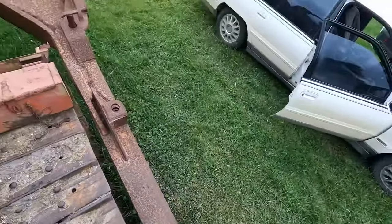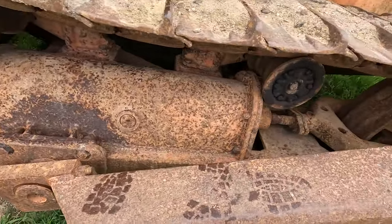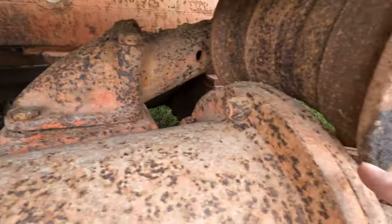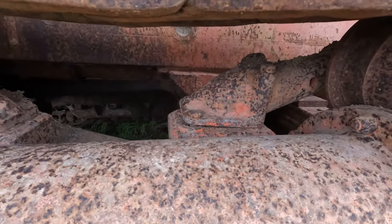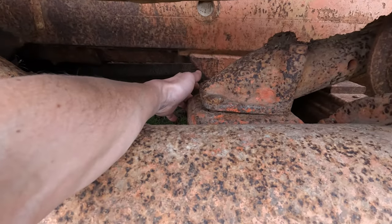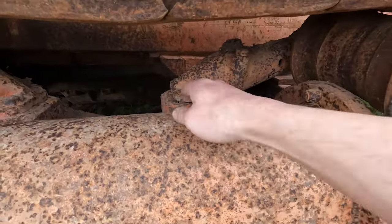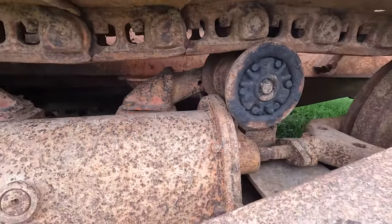One thing I noticed washing, I didn't wash it too hard here. I didn't want all the gravel to go into the paddock, so. But I was paying a bit of attention to this. See the gap in there? And see how close this is here? This has dropped down. Looks like these bolts have come loose or something like that. I was looking in the book, it actually looks like there's nuts on the inside, so I'm hoping I can jack the chains up, lift this up, get them bolts out and replace all them bolts. Yeah, you can see it's dropped a bit.